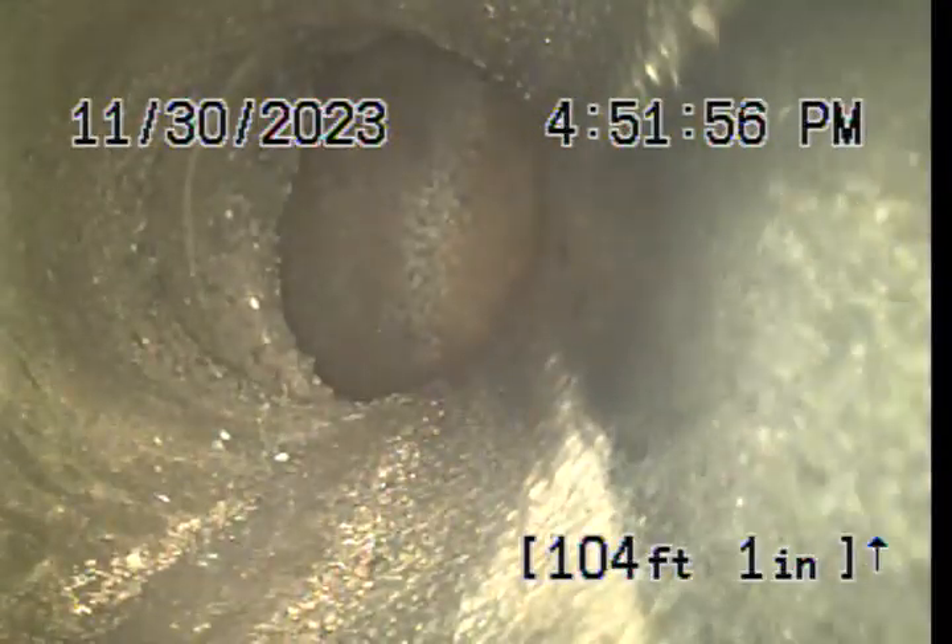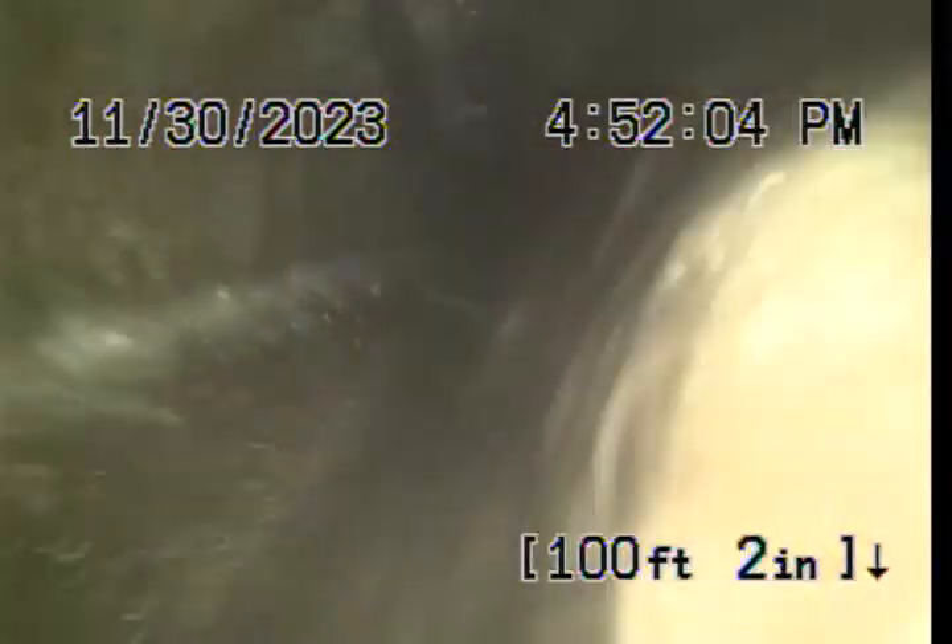We got our camera out at the city main sewer. That's 105 feet from our soil stack in the basement on the southern edge of the building. You can see that's the city sewer. We're pulling back here. This is a concrete pipe. There's a little bit of a belly late in this line near the city main. You can see the camera going under water there.